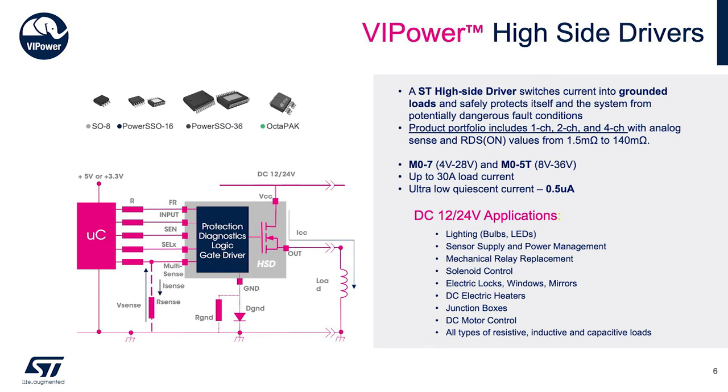So to start with high side drivers, what I'd like to do is maybe introduce the concept to you. Here, if I can direct your attention to the diagram in the lower left corner, you'll see that there's a microcontroller, and then there's an interface to this gray block here, which is a high side driver. Now, this high side driver has an integrated FET and has some very simple digital interfaces with the microcontroller, the most important being the input pin,